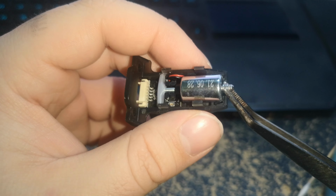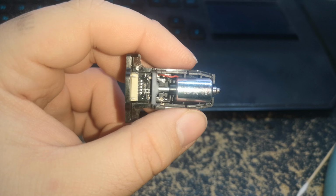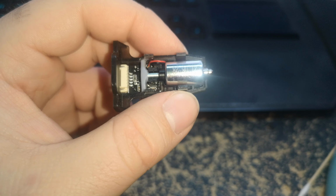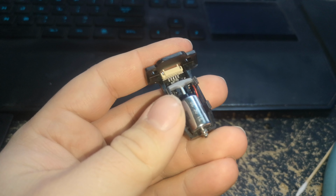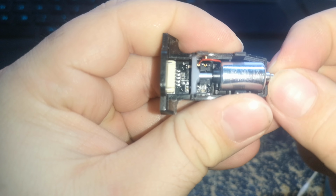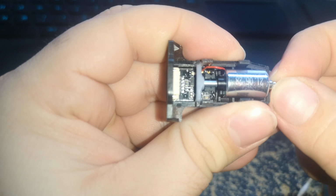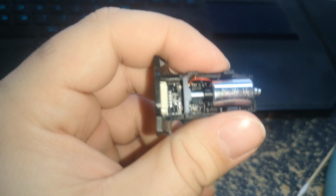Which, I mean, I bet BL Touch tried this, and were like, oh shit, that rattles, we can't have that. Yeah, I don't know. And the other thing is, if you put this in an ambient temperature chamber that's like 80 degrees, the metal and the resin are going to expand at different amounts, so that might add enough play for that back end to wobble. Right now it's rock solid. It's only the front that's making the rattle, but it's still completely unbearable.